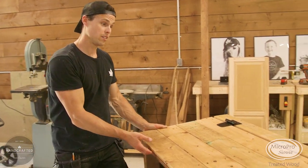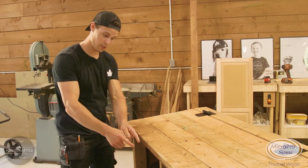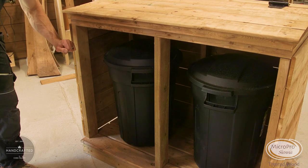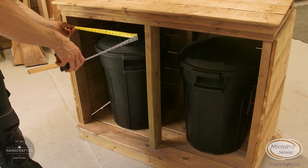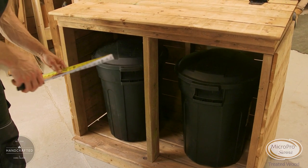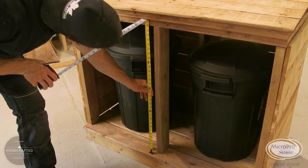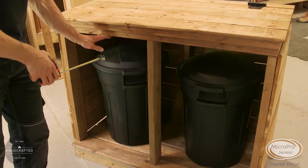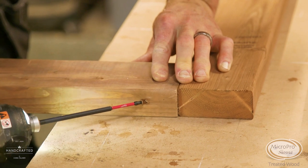Our lid is complete — it's time to build the two front doors. The hinges need to mount to the structural two-by-four so I'm measuring between the two-by-fours to get the door frame width. The width opening for the door is 21 and a half inches and the height is approximately 32 inches. I would make a 21.5 by 32 inch door if the wood was never going to stretch or expand, but we like to remove about a half inch — much like building a gate — so when the wood swells it won't jam and we can open and close it any time of year.